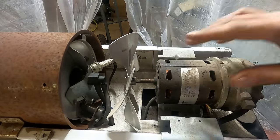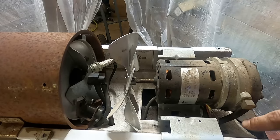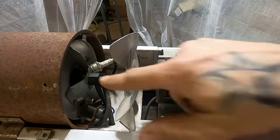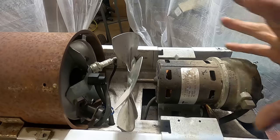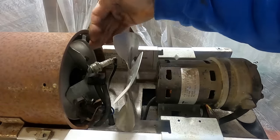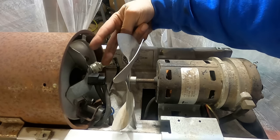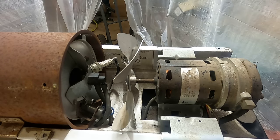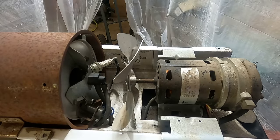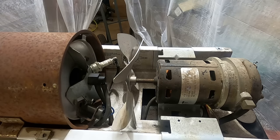What that prevents is atomized fuel spraying continuously into an unignited chamber while the spark plug is still sparking. So the photo cell shuts it down if it doesn't ignite within a certain amount of time, or if it dies while running. The only other component to know is this fan — it's pushing air into the combustion chamber. That's where you get the air in your air-fuel mixture and also what propels the heat forward. That's where you get the 'jet' in jet heater. So this pump and electric motor runs, generates air pressure sent down this line into the tank, Venturi effect up into the nozzle, and the fan blows forced air into the combustion chamber.